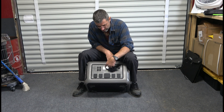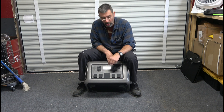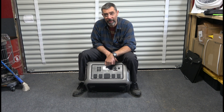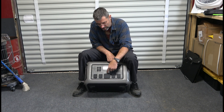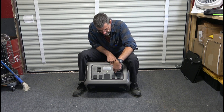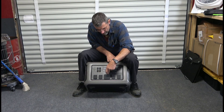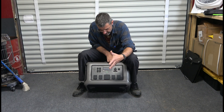So that's pretty awesome. 46% charge, zero watts in, zero watts out — 15 days of runtime remaining. Hopefully that gives you an idea of what I'm talking about: when we can measure battery capacity in days instead of hours and minutes, we're looking at a pretty serious piece of equipment. And then to power up the individual stuff, press and hold and it comes to life. We can also turn on our smaller inputs here, or the 12-volt output. We have the ability to turn on all three at the same time.